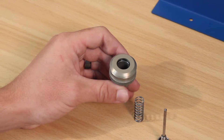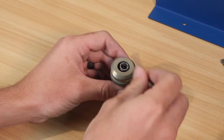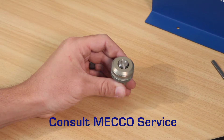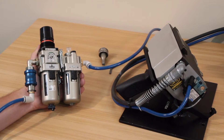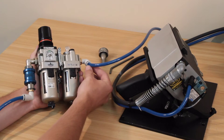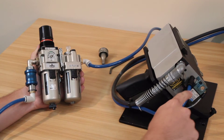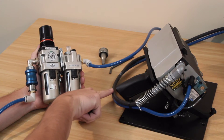This will require a very minimum amount of oil. If you have a dry O-ring or have excess oil on your part after marking, please consult MECCO service. The regulated shop air will be coming out of this direction and then going to the marking head itself through a solenoid. Some portable units will have the air hose and control cable enter through the pistol grip.